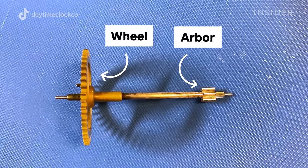It takes a certain feel. Once it's together, you get it up on the test stand and make sure it's still working right. Then there's actually a several-week period of testing — every time I come into the shop, I see if it's running fast or slow and make an adjustment. I like to get it to where everything is working completely properly for a whole week straight. Then I put it into the case to test it there to make sure it's all going to continue to work properly.